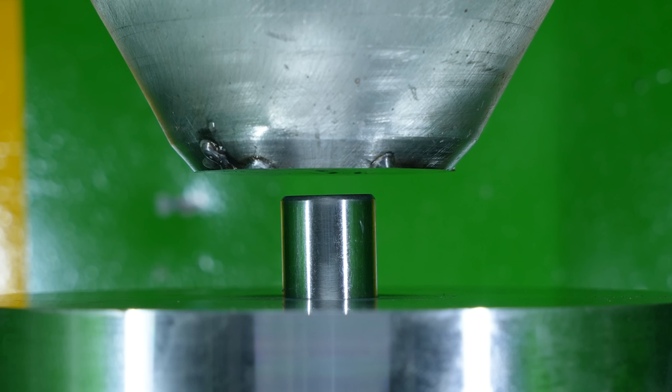And here is the upper part zoomed in. And we want to hit the 24 tons to get I6. And here we can see that when it hits 26 tons, it still goes down fractions of a millimeter, or maybe 1 or 2 millimeters, before it stops on the big tool. So if we assume that the force sensor doesn't have any delay, then it was just on the border.